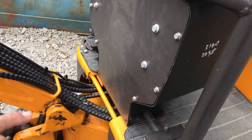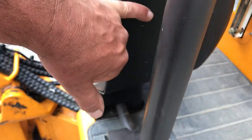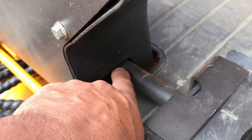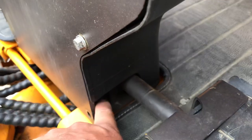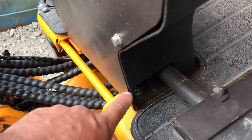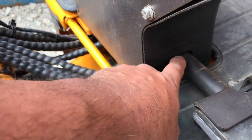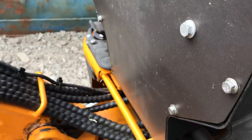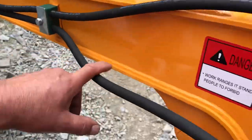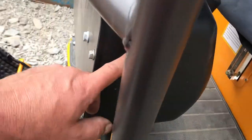The other mod I had to do — because I was putting new pipes in for the return filter and needed to fit my gauge — I had to take this cover off. There's an empty bolt hole there, and the cover wraps down there and across in a U-shape. There was no way you could get it off without seriously damaging something. So with a multi-cutter I just drew a line and cut a nice clean line — it's still not easy to get off but it's a damn sight easier. If you're in the middle of a maintenance job and one of these hoses goes, you need to take that off quickly. There are so many hoses going up into here — it's like a right bird's nest.